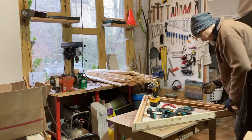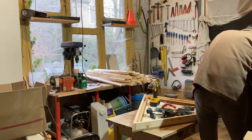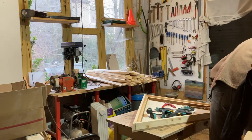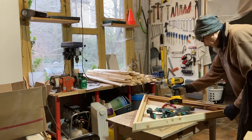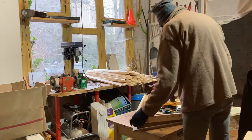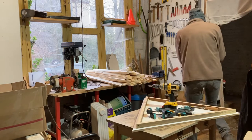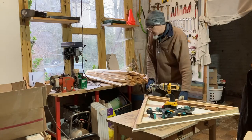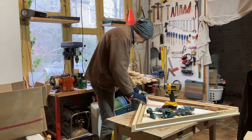The struts not all being perfect in length was the problem I encountered afterwards. When mounting the half hexagons, I saw that you need to be precise to the millimetre. So sometimes I had a little play, sometimes I had no play. This meant all my triangles were slightly different, which is not a good idea. So I had to dismount them all afterwards and rework them in another way — but you'll see that in another video.